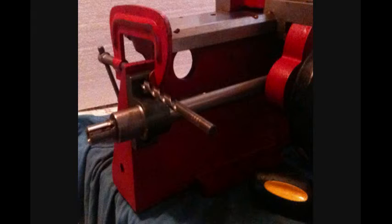Using the largest drill bit that would fit through the bushing mounting hole, I dimpled the location of the lower hole of the left-hand lead screw bushing, removed the carriage, put it up on my drill press, drilled and tapped the hole, and then had to repeat the alignment process for every individual hole.